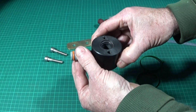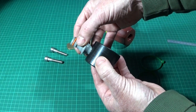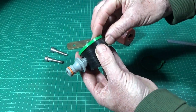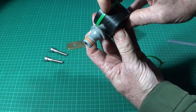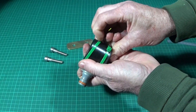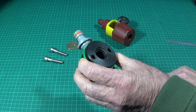I could obviously glue the connector in there so it doesn't pull out, but I wanted to be able to make it quickly and also take it apart to show how I made it. So what I do to stop it from pulling out is use zip ties — I just pull those down over the diameter on each side, and that prevents it from coming out accidentally when it's being used.